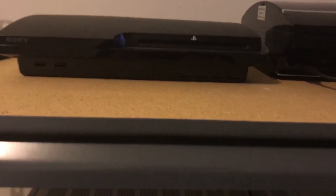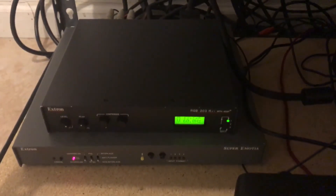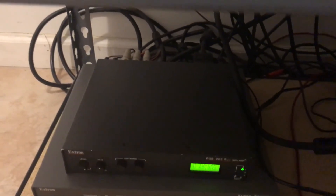For today's video I'm going to be showing the PS3 outputting SCART, running into the GSCART switch. I'll be outputting two sources at the same time: the first is a SCART cable going into a passive adapter into the RGBS input of my BVM, and the second is a VGA cable going into the Super Emotia, outputting as RGBS going into the Extron RGB 203RXI and then outputting from there as RGB into another card on my BVM.